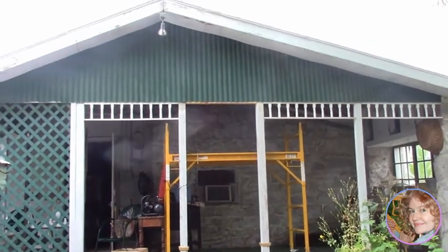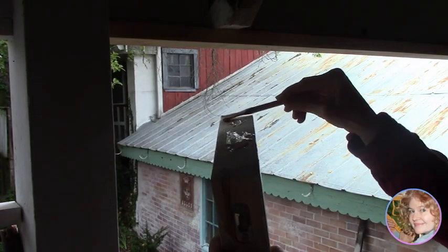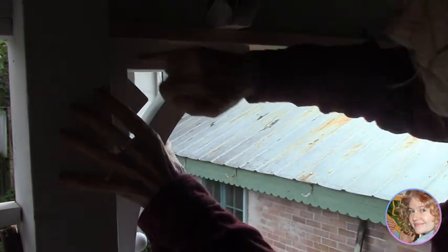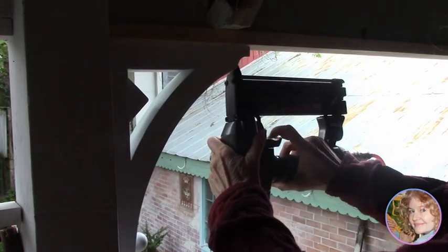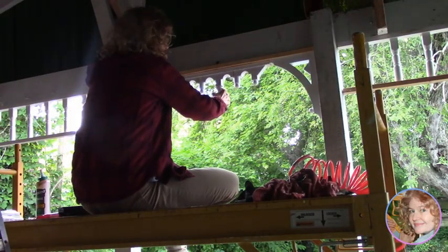The brackets go first. This is the hole on the back of the bracket. And we put a small nail in the post at just the right place. This will support the bracket while the glue sets up. We wipe off any excess glue, and then we add nails through the thin parts of the bracket. We don't want to try nailing through those thick sections, but the thinner ends make it possible for a 1 1/4 inch brad to hold these brackets in place.